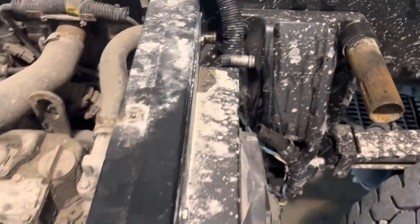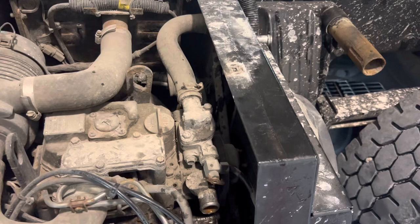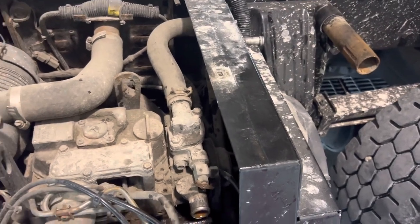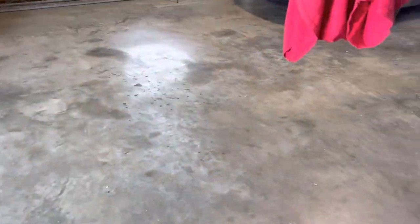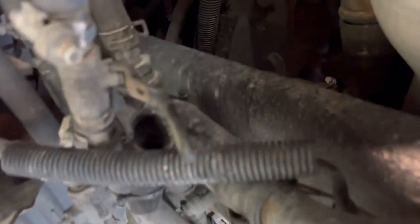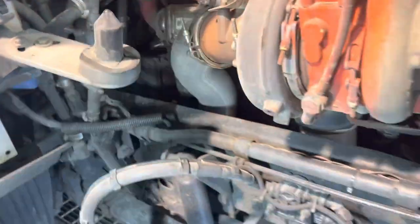If I have shutoff valves on this truck, and I'll show you those, which I would recommend you do, but if you don't, you better kink something off or coolant's gonna go out everywhere because it's tapped into the cooling system of the truck. And I'll show you. It's best to put them on up here. Hold up. You see one's there. That's the feed and that's the return. So I got them shut off so no coolant will go back there.